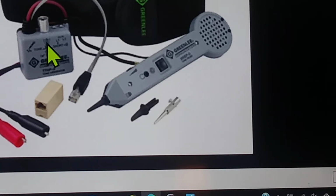Didn't have to. If you take that thing and put it in the middle, and you know the difference of the brightness between 12 volts, 24 volts, and any other voltage, you could touch it and check the brightness of that light. That light's real dim, okay, I'm reading through a resistor. That light's a little bit brighter, okay, I'm reading right off the battery. You can use it as far as checking power circuits, all because this switch is in the off position.